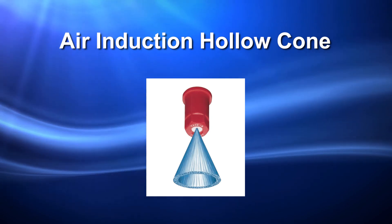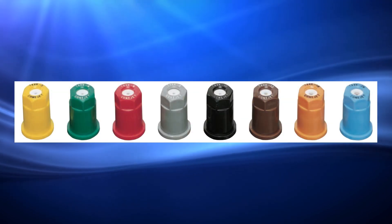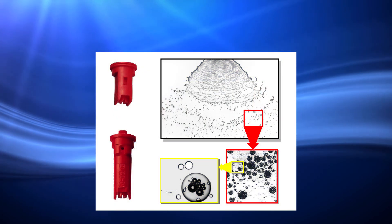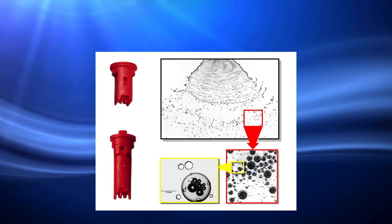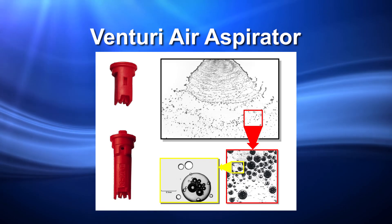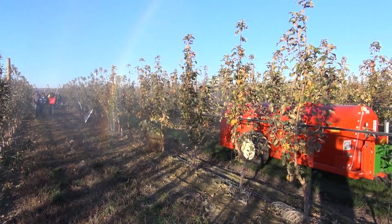Another option is the air induction hollow cone spray tip. The nozzle is typically made only from ceramic. As with the hollow cone spray tip, the air induction spray tip is also color-coded to readily identify tip or orifice size. The air induction spray nozzle produces larger droplets compared with the standard cone spray tip. The larger droplet size is achieved by means of a Venturi air aspirator. Air is encapsulated in the droplet, making the droplet larger or full of air bubbles. The larger droplet, even at high pressures, reduces the potential for drift under adverse weather conditions while also improving canopy penetration.